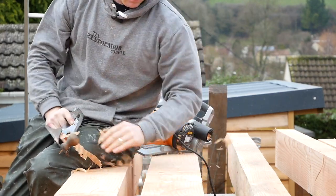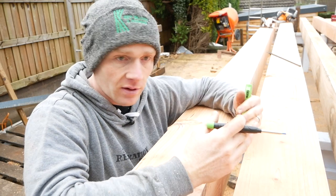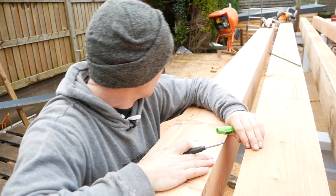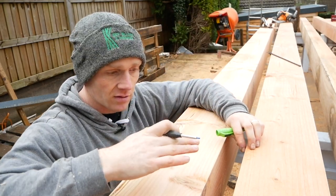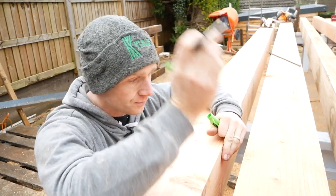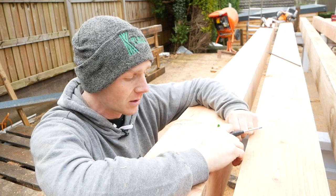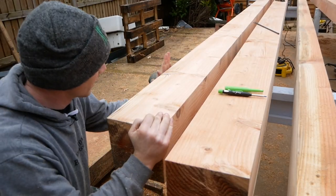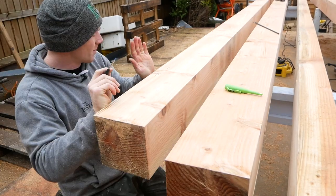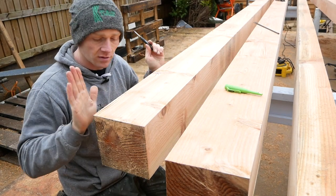What we really need to do now is start labeling these up so I know exactly where they're going even through the layout phase, so I'm not shifting things ten times. This is going to be our west beam. It's a very simple construction — we're using seven-by-sevens for all our posts and beam along the top and bottom. To reduce timber, since it'll be unnecessary, I'm just going to use a seven-by-four for the sill. I want the sill to be fairly straight because any deviation will telegraph through to our cladding with the insulated panel system. I'm going to make this the outside reference face, because we want the outside of all posts and beams to be flush.